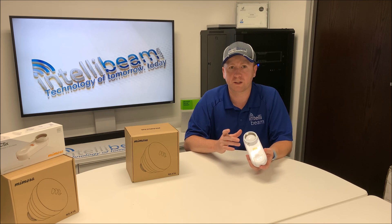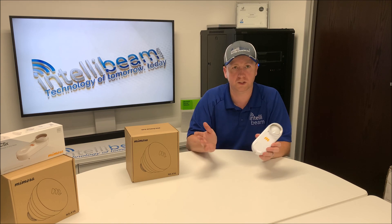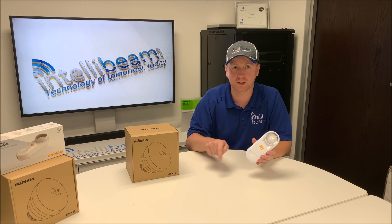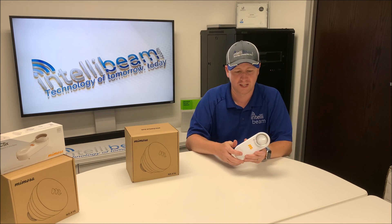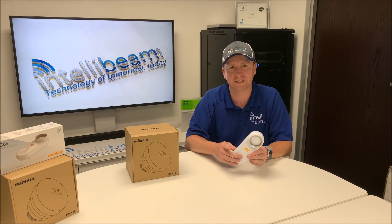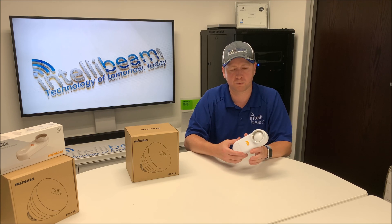This particular radio is 8 dBi by itself. If you want to use it standalone, just take out this screw and you can use it as an 8 dBi radio. More importantly, there's no PoE in the box, so make sure you buy one in advance. The speed on this is up to 500 Mbps point-to-multipoint and 700 Mbps point-to-point, with a frequency range of 4.9 to 6.4 GHz.